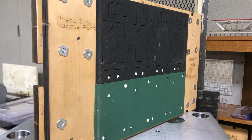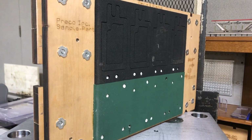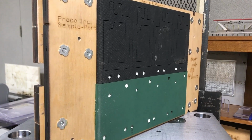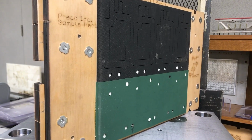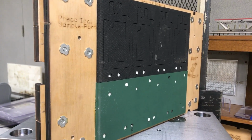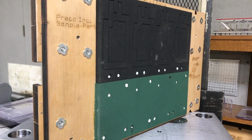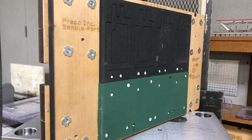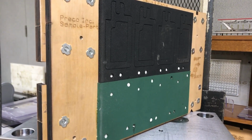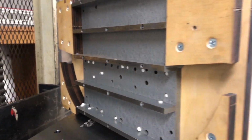What you can do is you can mix and match your ejection rubbers to compensate for areas where you may have more pressure or less pressure due to either too much or not enough die rule. So down at the bottom, what you're seeing is a very dense, hard ejection rubber, and up top is what I'd classify as a medium. And what that does is that actually causes the tool to come down fairly level. In fact, after that was done on this die, we went from having a lot of make ready up top to keep it cutting nice and square and flat, to having 0 make ready just through a change of ejection rubber.